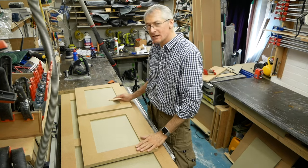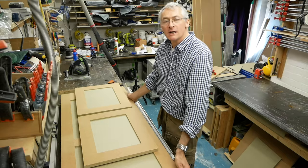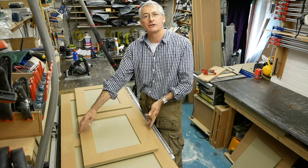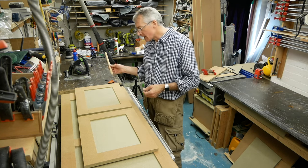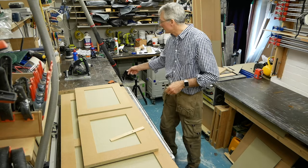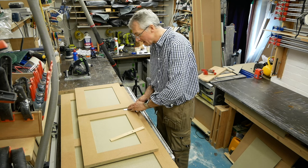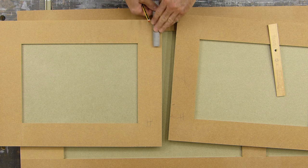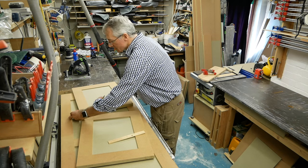We're back in business — I had to nip out and do a quick job; this work stuff sure does get in the way. Before I went, I marked up the hinge positions for the big doors using a story stick. I also have a small story stick for hinge positions for smaller doors, but these doors are actually really quite tiny — they're only 430mm top to bottom, about 17 inches. So if I use my standard hinge markers they're going to come up way too far in-board. What I'm going to do is bring the hinges in line with the tops of the rails on either side — that'll be about 80mm on each one. So I'll just mark those up quickly and then we can start cutting the hinges, which is probably one of the last messy jobs to do.